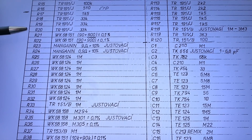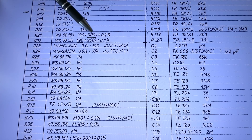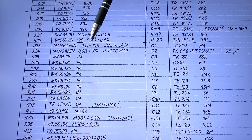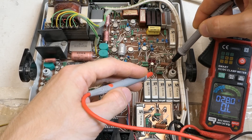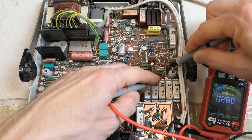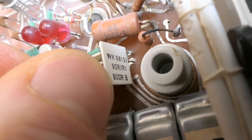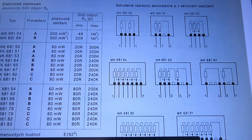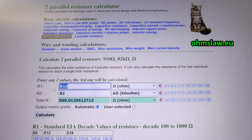Now let's look up the values of these resistors. The current sensing resistors are R1, 2, 3, and 4. For the highest current range it's using 0.9 ohms, then 9 ohms, then 90 ohms, and finally 900 ohms. These are the wire resistors and this seems to be two resistors in one package. Measuring them: this is probably 0.9 ohms, then 9 ohms. And this ceramic rectangle is probably two resistors in one — 90 and 900 ohms. This section measures 90 ohms, but the other section shows several mega ohms, so this is the bad one. It's a two-in-one resistor — 90 and 900 ohms — with three pins on a ceramic board. I don't have a 900-ohm resistor, so let's use a 910-ohm resistor in parallel with an 82 kilo-ohm resistor to get extremely close to 900 ohms.